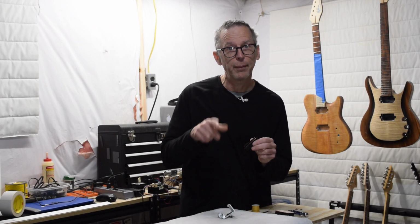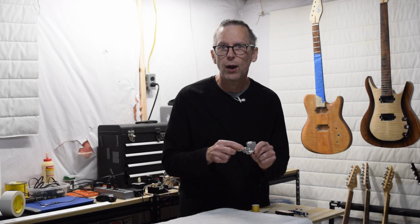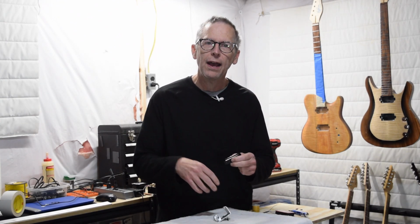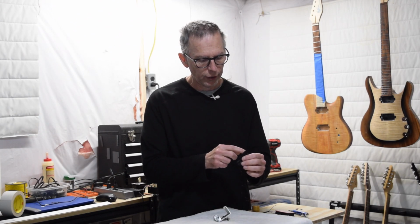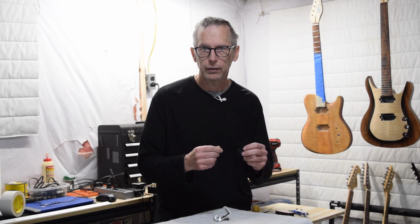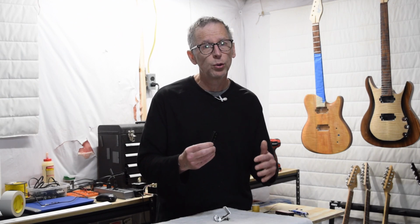So you can kind of see how the length of the wire is going to determine how the pickup is going to sound. And the length of the wire can be determined by two things: the number of turns that we put on the bobbin and the amount of tension that we apply to the wire as we're winding the coil. To calculate the number of turns of wire that I'm going to put onto a bobbin, I have to execute a fairly simple mathematical formula which takes into account the perimeter dimension of the bobbin's internal core, along with the desired level of resistance that I want to achieve, and the measured or known amount of resistance in the particular wire that I'm going to use. However, initially this formula doesn't take into account exactly what the tension is going to be. Instead, it just assumes that this is going to be a perfectly wound bobbin, which of course it's not.